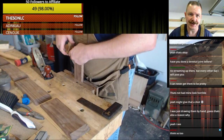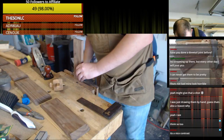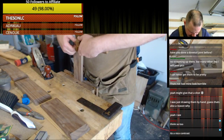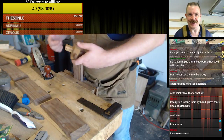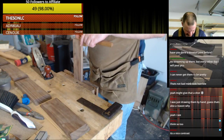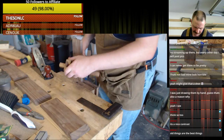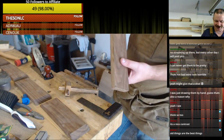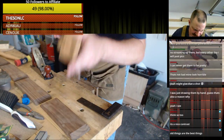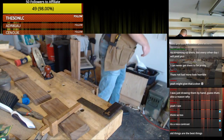And I actually hoped at some point to start making marking gauges like these. This is an old Stanley number 61 marking gauge is what it tells me. And it's got a wood thumbscrew, which I find significantly more pleasing than metal thumbscrews. One of the disappointing things I found with the bookends, and that was basswood against red oak, is there was definitely not enough contrast. That inlay is going to be covered up by books, so it's kind of a silly thing to do in the first place. All right, that should be sufficiently marked for my purposes. I'm saving this marking gauge, don't adjust it. But like this guy right here with the metal thumbscrew, don't much care for that. It works. Just don't really care for it.